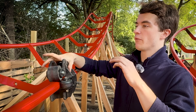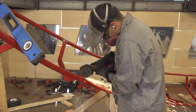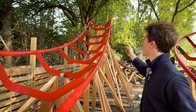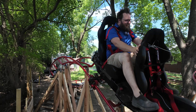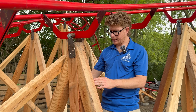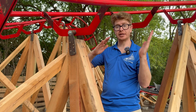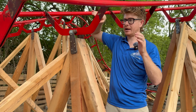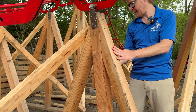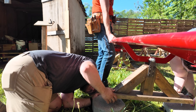The final production version will have a bit smaller gauge, but we'll have a two inch rail diameter along with a large three inch spine. This ensures that each track piece is rigid on its own, ensures we need less supports, and also ensures that there's less deflection when you're coming around these turns at high speed. Once the weight comes through here, we actually have the column going all the way to the ground, and then two diagonal pieces that help with the track's rotation. The coaster is coming down and applying forces in this direction — the weight is being distributed along this angle, pushing into the ground, and the weight of this footer helps prevent it from tilting up.